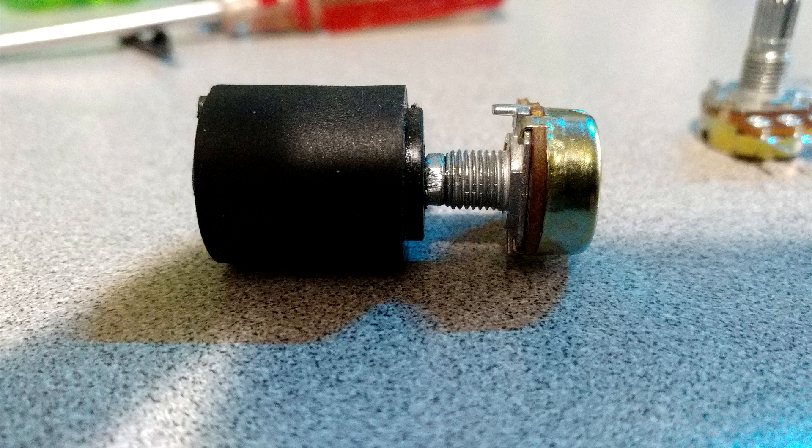You want to be careful — make sure it is ground down evenly and spins evenly. Because at the top left you'll see the little pin that comes out, and that actually attaches to the base of the handbrake. That is what spins the cylinder, which spins the potentiometer. You can easily break that cylinder, so you've got to be careful.